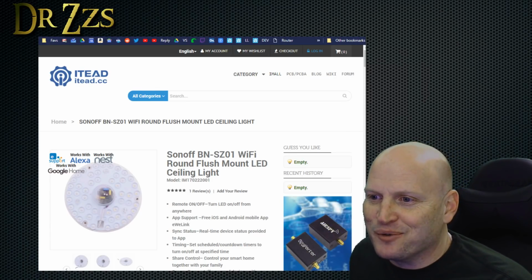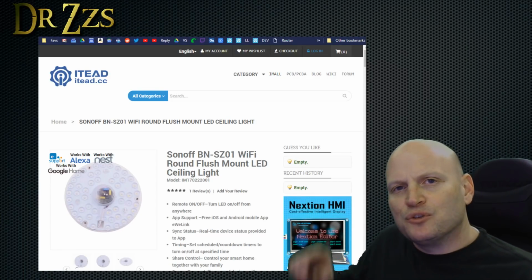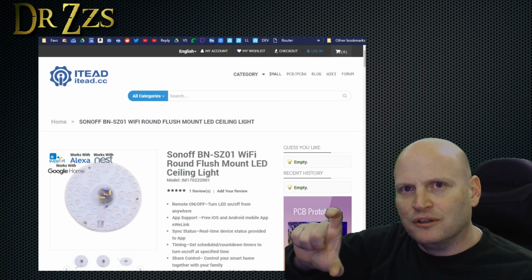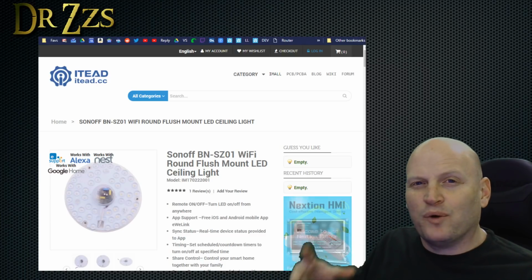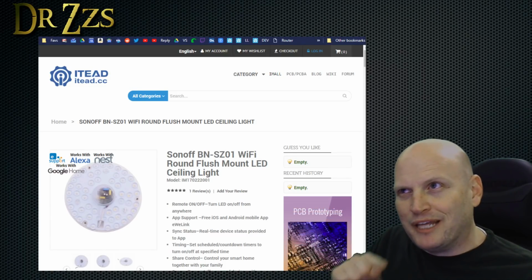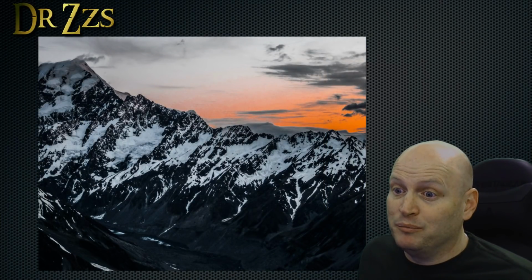Still bastarding hardware together to get a 2-wire smart switch working. Just waiting on the switch and my change to be pulled into Home Assistant. So, Ryan, you've got to tell me how you're planning on doing that. You're talking about taking just the switch legs that come down from the power source and the light to the switch and go back, and putting your whole smart device there. Do you have a battery in it, or are you going to run a tiny neutral to ground, or do you have some other internal fancy electronics way to have a voltage for the ESP chip to use? Because that sounds like a pretty cool deal. I know a lot of people would make a lot of use of that. There are plenty of people who were asking me before.